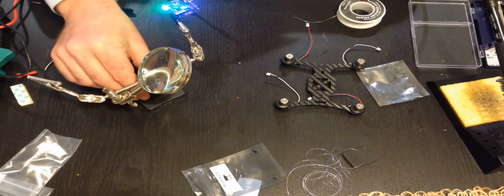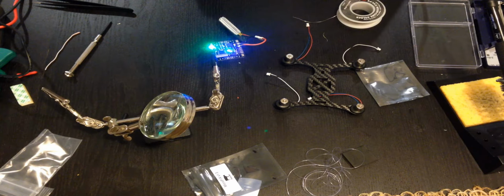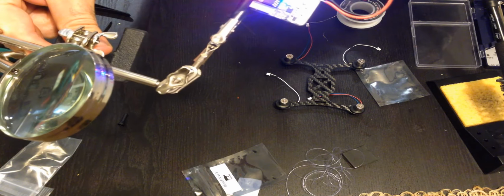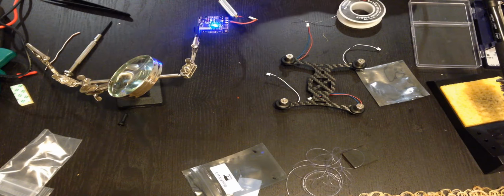Wow, that's a learning lesson. Well, I tried everything to short the bind pin, and it didn't work. And I soldered it, still didn't work. And I put a ton of solder on there, which is on there now. And now it's finally looking like it's binding by the red flashing light. But Jesus, that was really freaking hard.